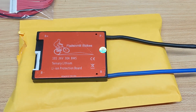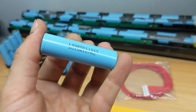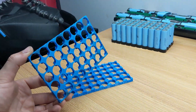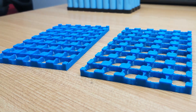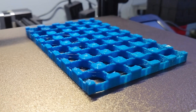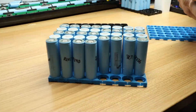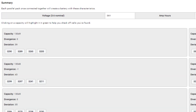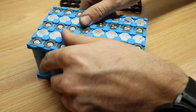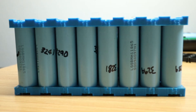As far as parts needed for this build, you will need a BMS system like the one I have here and your 18650 cells of choice. Here are the specs for the MH1 cells I'm using today. To put all the batteries together, you need a case or layout to get all the batteries organized. I've 3D printed my own battery case — this keeps all the cells individually spaced to allow ventilation and ensure safety. When assembling the battery pack, make sure each parallel series of cells has approximately the same capacity so not one drains faster than the other. Once you've got the correct layout, slap on the other side of your battery case and begin welding the nickel strips on.